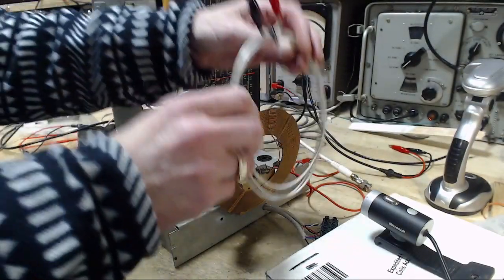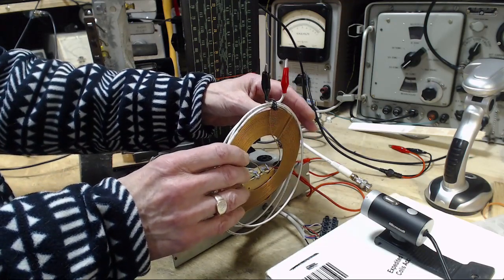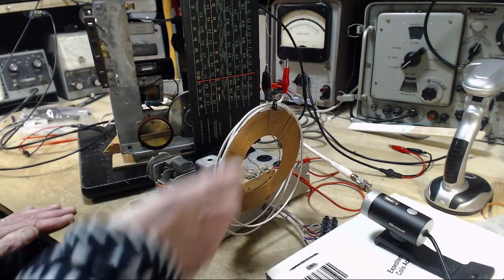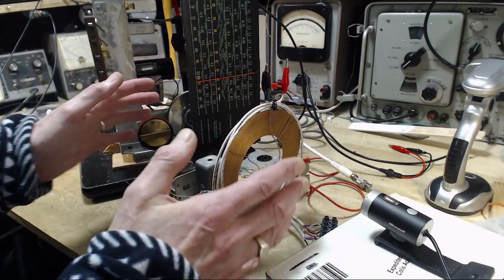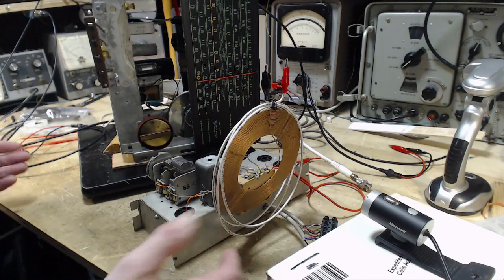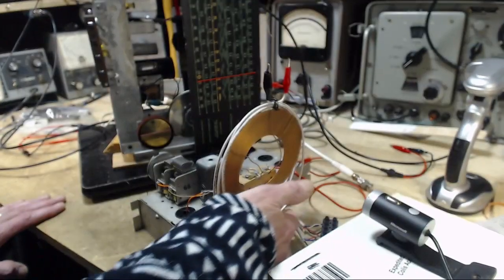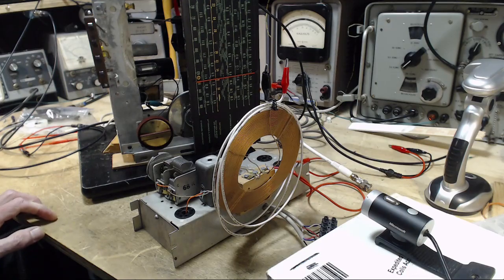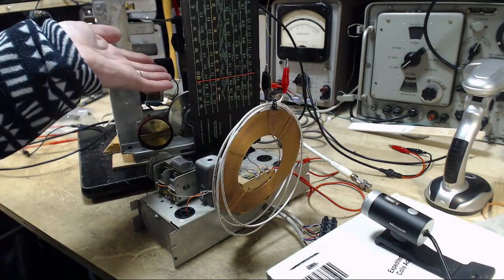And then hang this. This is what I've been doing because I'm still kind of experimenting with it. Hang it like that. Now what happens is signals coming from my outdoor antenna are in this white coil. And if I make this coil resonate at a selected frequency, maybe 640 where there's a radio station, any 640 oscillations coming from my antenna are then jacked up and made stronger and radiate off of this thing. And then the radio I'm testing can pick it up.